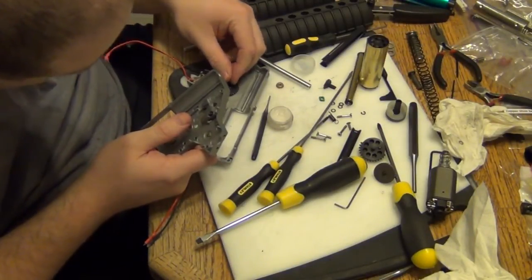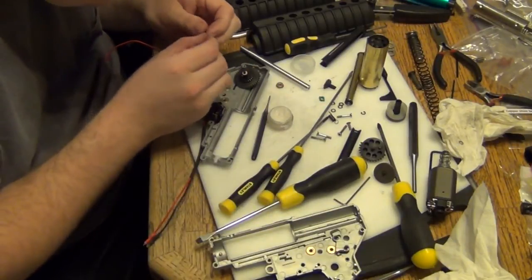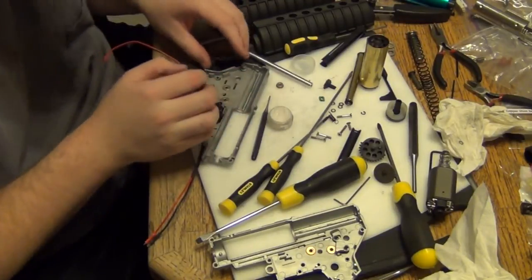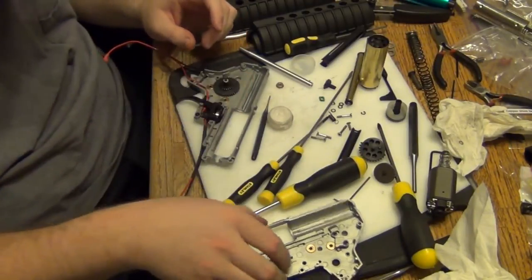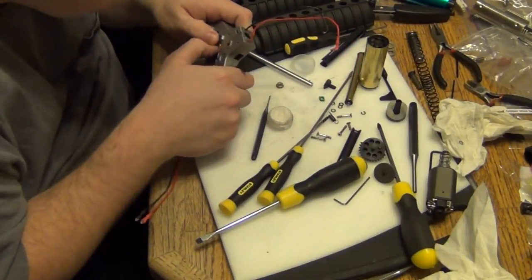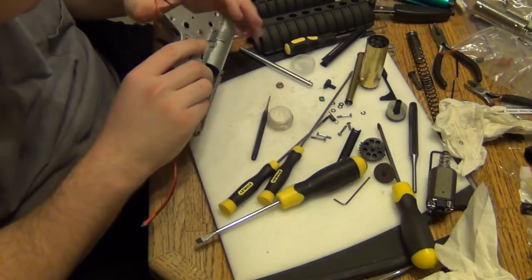Usually you find this kind of grinding if you look down at the bushing. You'll see the cut up of it. I found one bushing on this gearbox shell that was kind of damaged. I don't know why it was damaged the way it was, but it's still usable. It was damaged on the outside, like if someone had hit it with a hammer or something. I don't know what the heck, but I just put it right back in there because I have 6 millimeter bushing replacements that I could put in there, but I'm just going to keep them for a rainy day. You never know. The parts still work fine. Why should I replace them completely? It's not going to make really any difference.